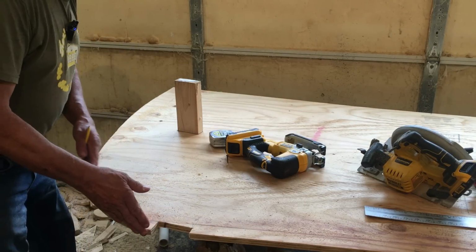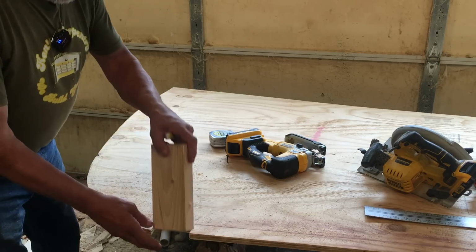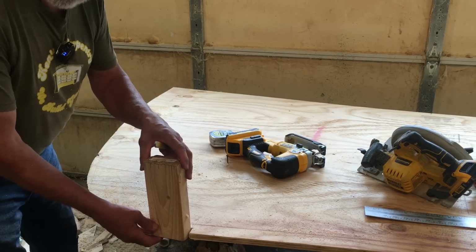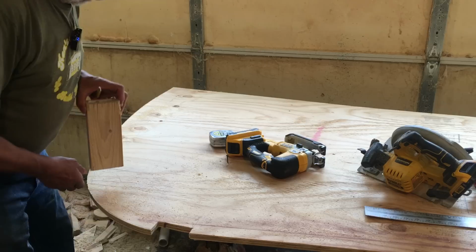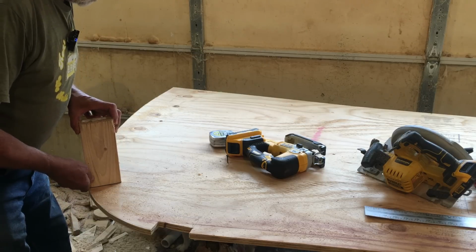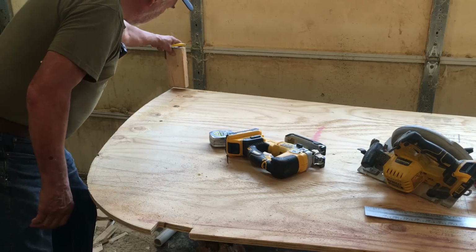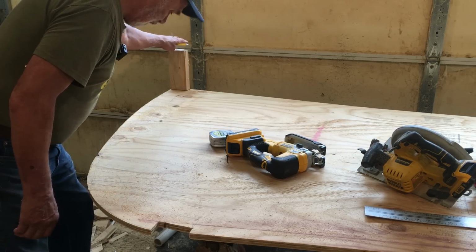Okay, I've calculated all of the rafters that are going to go on. There'll be this that has to be a certain length, 12. It'll be 12 feet long. So there's a subfascia here, and then the first rafter at this angle, here, here, and here, so that when we put the two halves together, this one will be doubled.